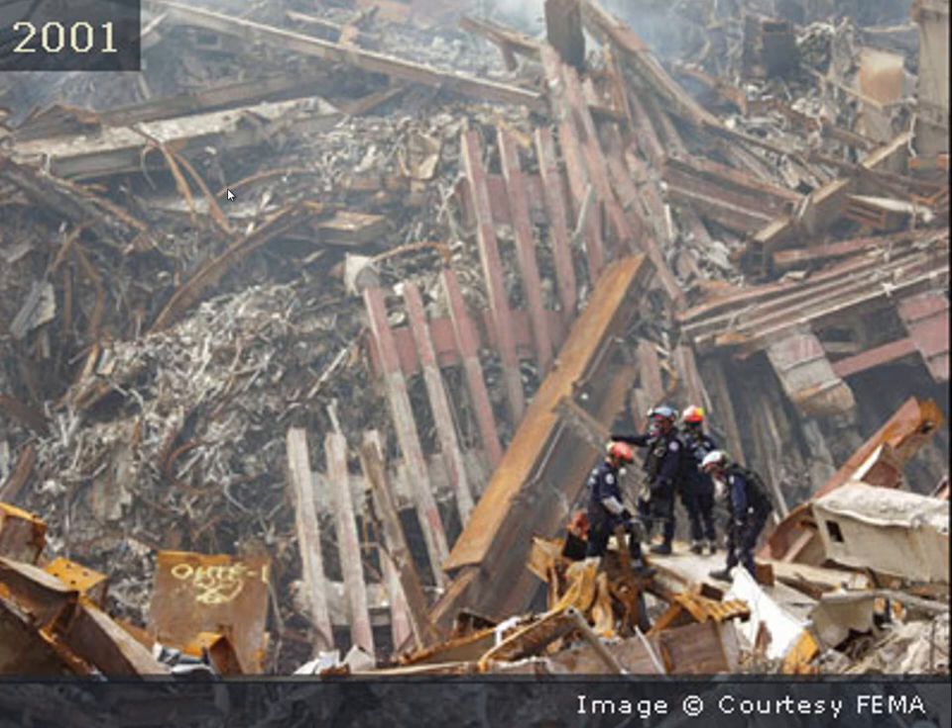The World Trade Center was an example. The entire exterior tube was a series of vertical elements welded to horizontal elements that ran across at each floor. In this manner, without fully triangulating the façade but using a fairly dense structure with really good sturdy moment connections, the stability of the structure was assured. There were no internal shear walls, no concrete walls in the core, which gave great flexibility in the layout and design of the building, but turned out to be part of its weakness in that the fireproofing on the vertical circulation was basically sheetrock.